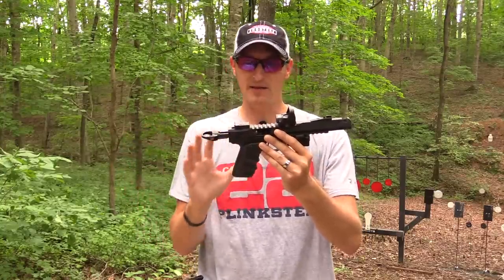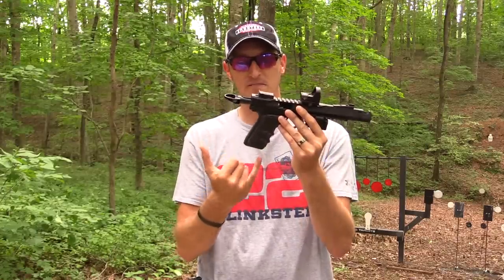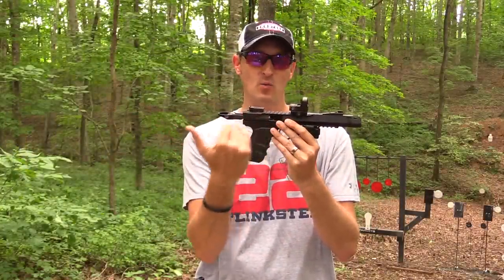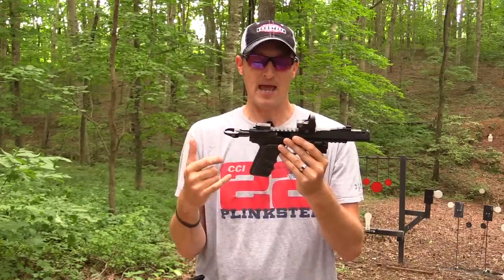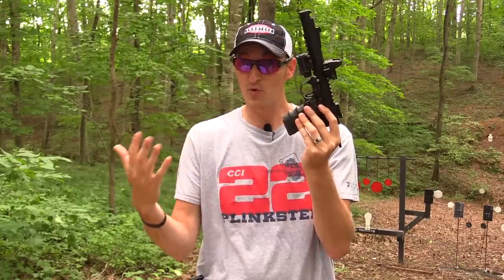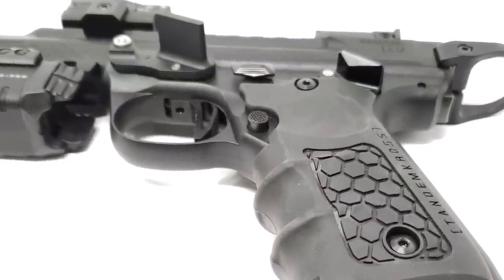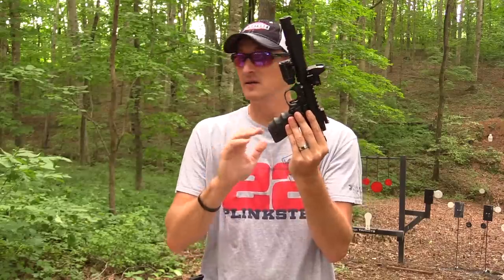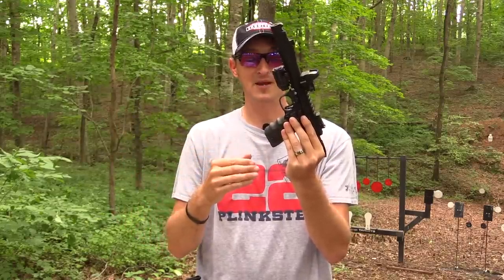When I first got the handgun and replaced everything, it would not work — very frustrating. What would happen is the magazine would not seat deep enough; the bolt would ride right over the rounds and not pick one up to chamber it, time and time again. The culprit turned out to be the magazine release. The factory Ruger magazine release was not locking the magazine up tight enough to allow the bolt to pick up a round. Once I replaced it with the Volquartsen magazine release, no problems at all — the magazine locks up extremely tight and it picks up every single round.